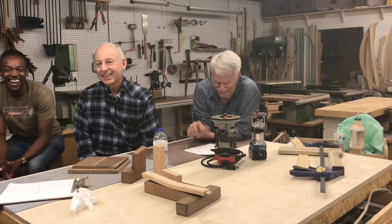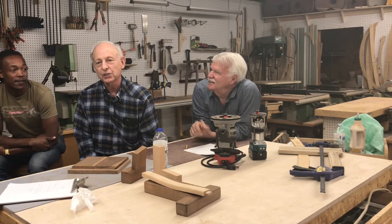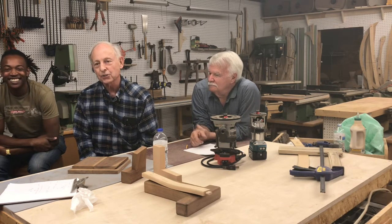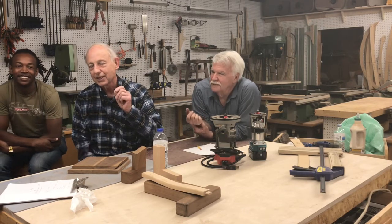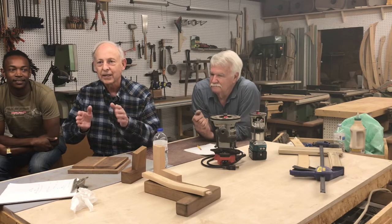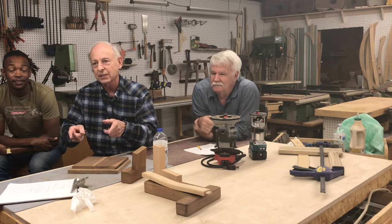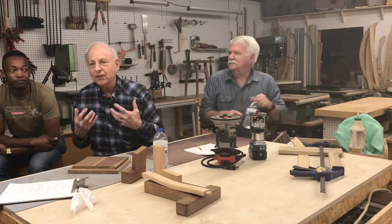I disagree 100%. If somebody said, I'm gonna take your table saw out of your shop, I'd shoot him right between the eyes, okay? I've got a Delta Unisaw that's 25 years old, and the total runout on the blade is 2/1000ths of an inch. I've got a digital readout that goes out to 1/1000th of an inch. I can cut dado joints, I don't care what you tell me to cut, 0.926, and I'll give you a dado joint that's exactly 0.926. So it all depends on your personal feeling about all this stuff.